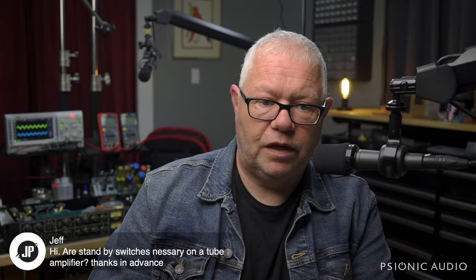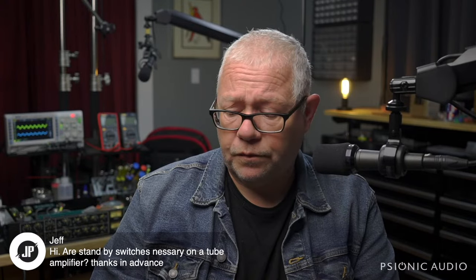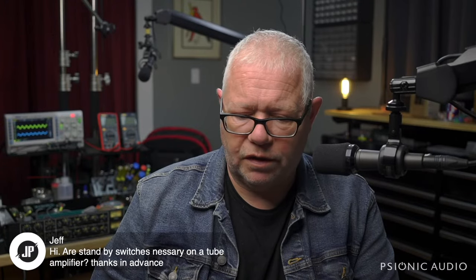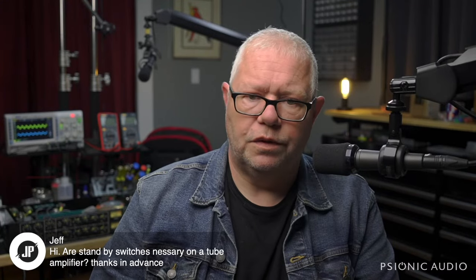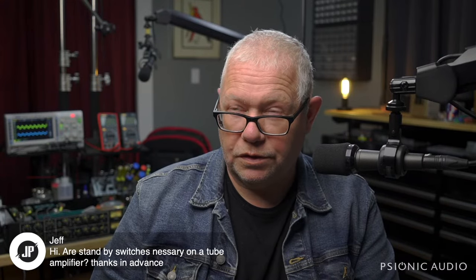Hey, Jeff asks, hi, are standby switches necessary on a tube amplifier? Thanks in advance. There's not a simple answer to this. I've done videos on this. If you have an amp with solid-state rectification, use the standby switch. Just use it if you have an amp with solid-state rectification. If you have an amp with a tube rectifier, generally you don't need to use the standby switch. That's the best way to put this.